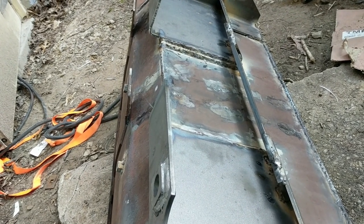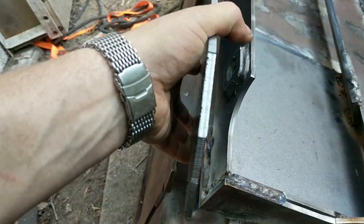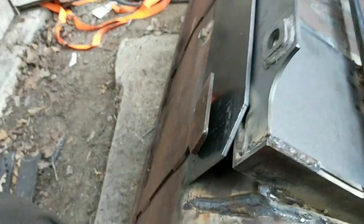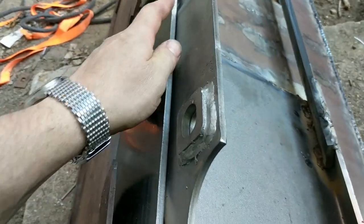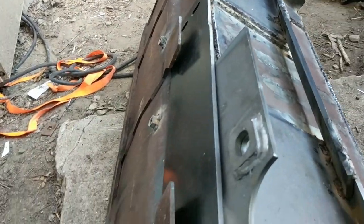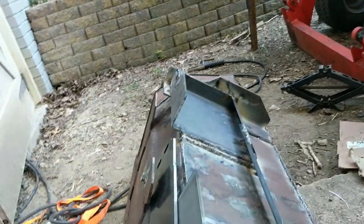Looking through my various pieces of steel, I have this quarter-inch plate that I think I could put into that corner and span this gap. I'll cut this into thirds, decide on some kind of piece of metal to span that gap, and then tie a cross member to here and tie this piece to that. I'll go ahead and make that final adjustment, and then other than the cutting edge and the reinforced cutting edge, the bucket will be complete.